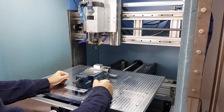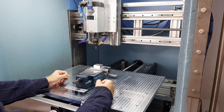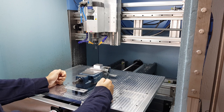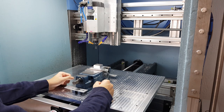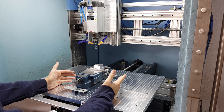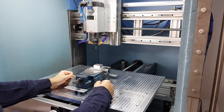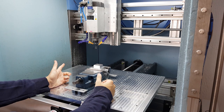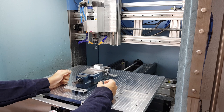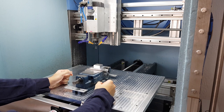Let's talk accuracy. This machine can hold 10 micrometers — at least that's the resolution of my linear encoders. I made some good design choices and some really shitty ones. For the ball screws, I have C7 Chinese ones. The bearing blocks are also basic, but I changed the bearings inside to SKF bearings — not thrust bearings, but radial bearings.